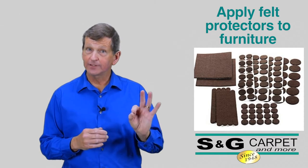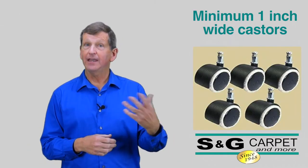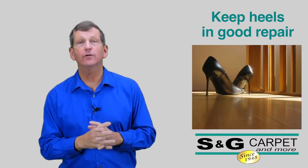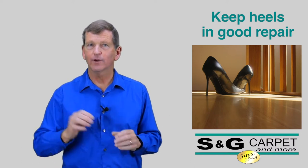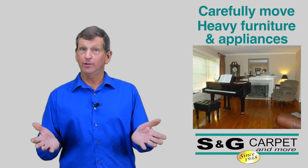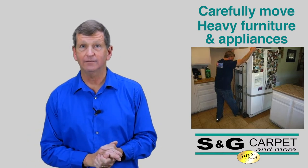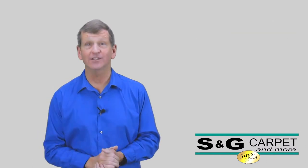We want to be sure to use felt pad protectors on all furniture, chair, and table legs. If you have chairs that have casters, make sure the casters are a minimum of one inch wide, flat, and keep them clean. If you're prone to wearing high heels or stiletto heels in the home — especially if they're in poor repair — you might want to rethink that, because those will damage your hardwood floor. If you want to move a heavy appliance or piece of heavy furniture, use an appliance dolly and roll it across a piece of plywood or masonite to protect your floor. And let's not forget the pets — it's important to keep their nails trimmed to help minimize scratching.